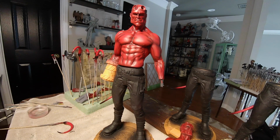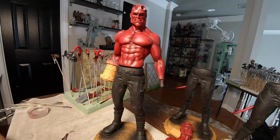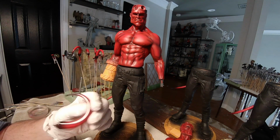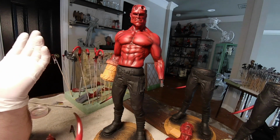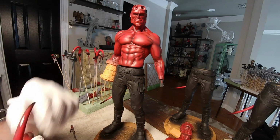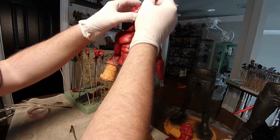And now that I'm looking at it, yep, I have to wet sand these. When I was spraying, I saw dust, but now I'm looking at it and it's not showing up. So I must have put enough clear coat on to hide it. As I was mentioning before, there's dust in all my pieces, no matter who I've built them for. By the time you top coat and everything, a lot of times it doesn't stick out. Sometimes I'll have to go back and do a little cleanup, you know, sanding and stuff.